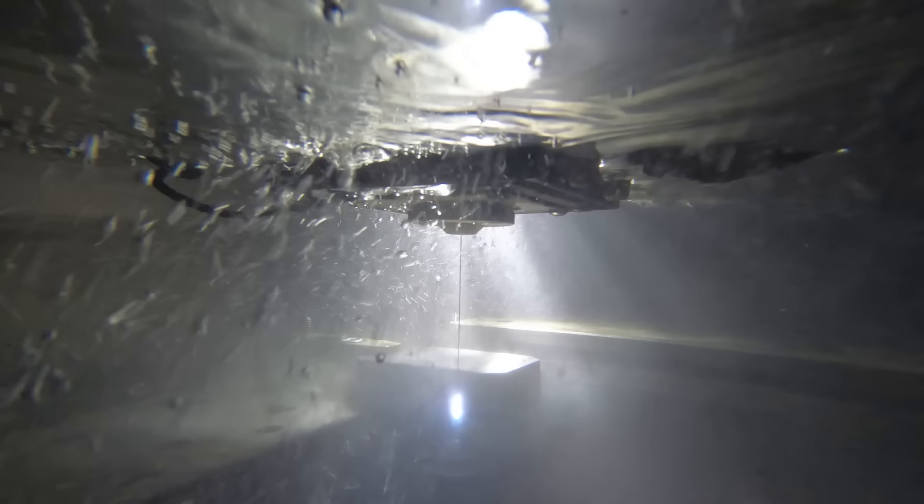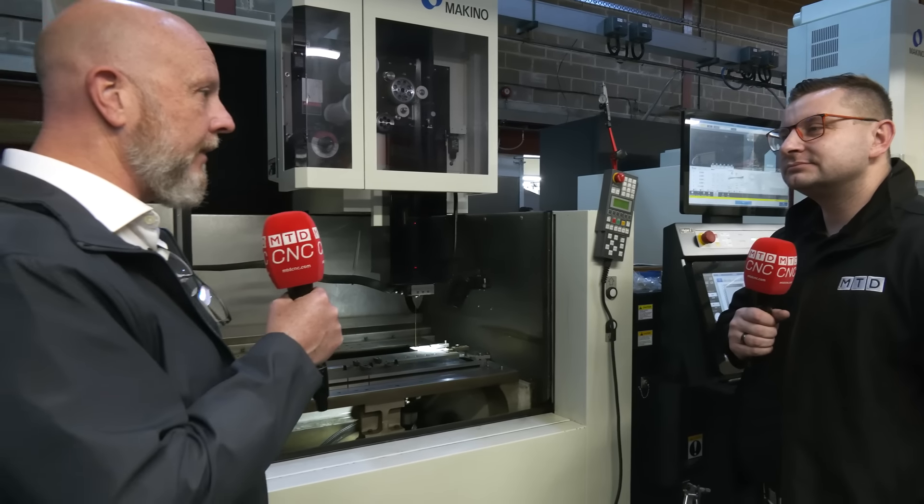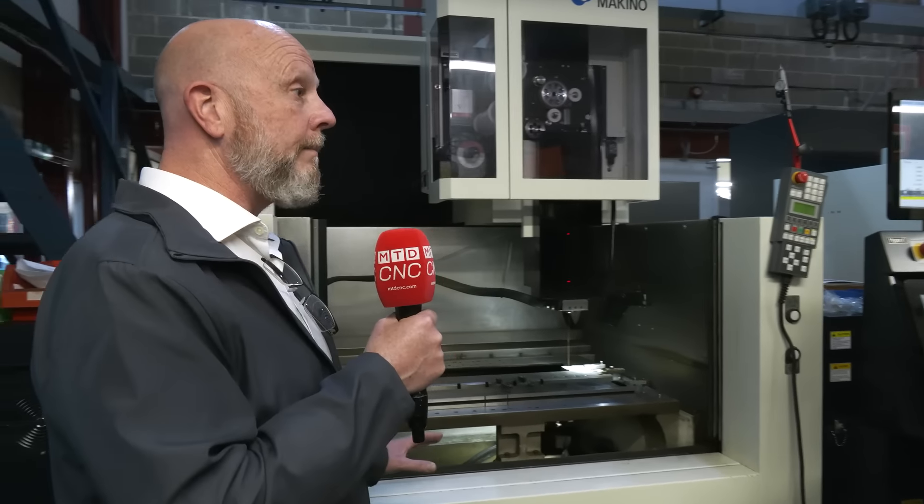You said this machine is twice as fast — what's the reason for that? Well, effectively, it comes down to the fact that it's got a 0.4 wire. Over and above the conventional 0.2 or 0.25 wire, the 0.4 can take a higher load, and that comes through from a higher capacity outlet on the side of the machine. So we can get more power through it, and it can go twice as fast.